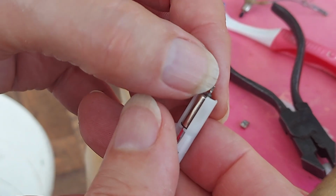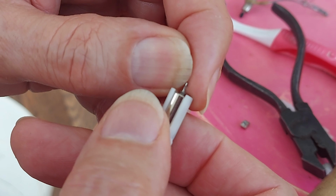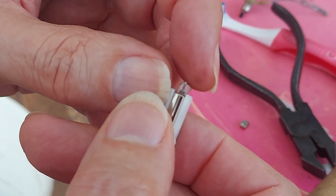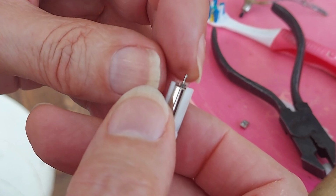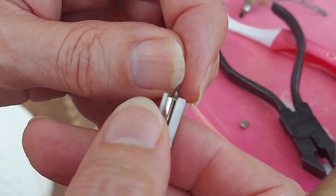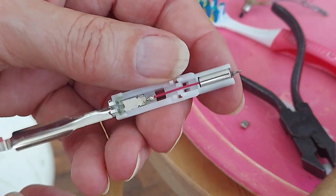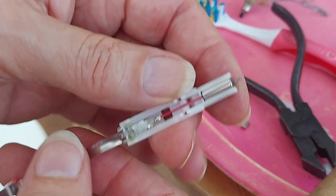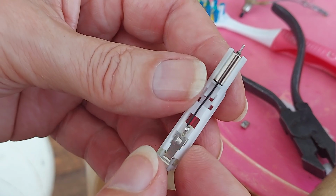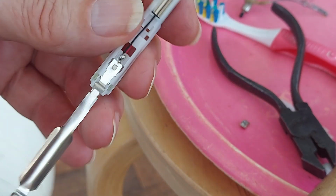We need to put a bit of rubber on there, well, a few bits of heat shrink. If you put a bit of heat shrink over it, shrink it down, then another bit of heat shrink over the top and build it up gently. Or you could just use a little blob of hot glue. You just need some sort of head on it to grip the ground, because that's what's going to actually drive the beam bot around. Right, I'll desolder them so we've got as long a piece of wire as we can.